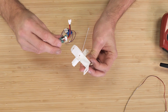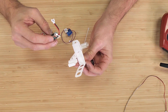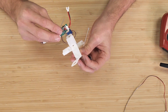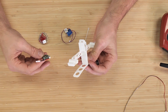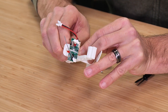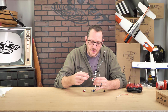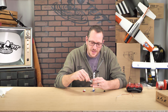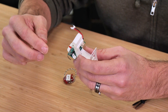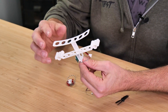The first thing we're going to do is fasten our little control board onto our gondola. You'll notice there's a top and a bottom hole — this gives us the ability to zip tie the control board onto the gondola, making it easily removable. This is specifically for STEM programs or youth programs that want to take these electronics off and switch them to other platforms later. Pass the zip tie through and tighten it down — it doesn't have to be overly tight, we just don't want it to move easily. To protect your antenna from getting knocked off during takeoffs and landings, just pass it through the bottom hole, which makes the antenna bend sideways so it won't snag and fatigue as it rubs against the ground.